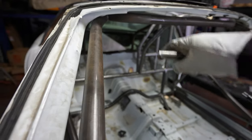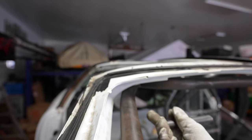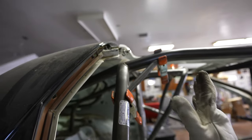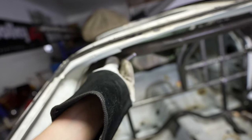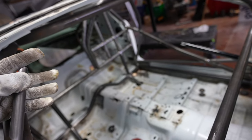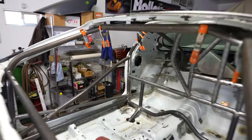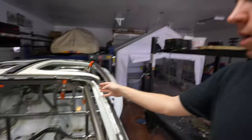Since this isn't exactly a 45 because it's not a perfect 90, it's a little off, but actually not bad at all. A little bit of grinding on the front side of the gusset will help it set in better. After working this one, I had to work the insides of the bar to get it to tuck up in there tight. On this next one it's almost the opposite — it touches both outsides, so I need to grind around in this area on both sides so the bar can come through a little more. One, two, and three gussets all installed — massaged them in there, looking pretty decent. Should be good to weld. I'll tack them all together, get rid of the clamps, and then weld all those bars.